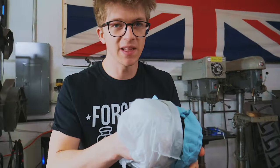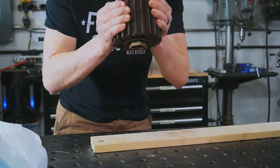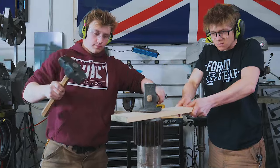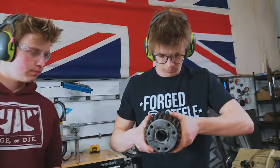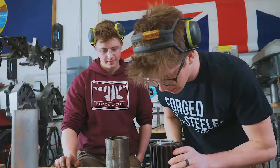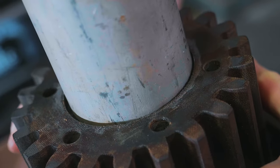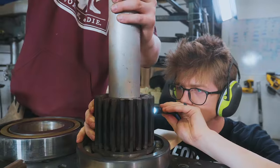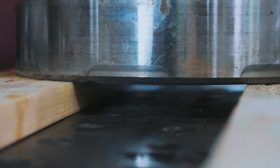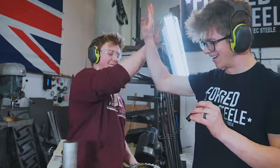It's the next morning. This has been in the freezer all night — it's quite chilly. Freezing it hasn't worked altogether too well on its own, but with a support built to push against, that moved it. We just needed to make something to support this properly. It was so close but not close enough to feel good about it — then one attempt was better, much better. And then — out! Look at that. That was an ordeal, but we now have a free grease track inside the gear.